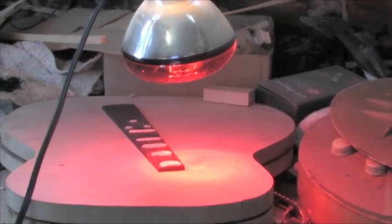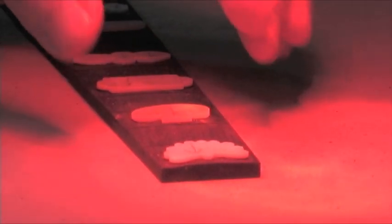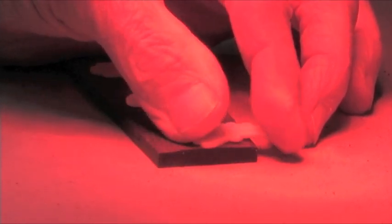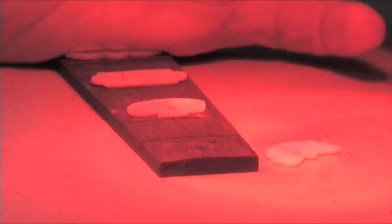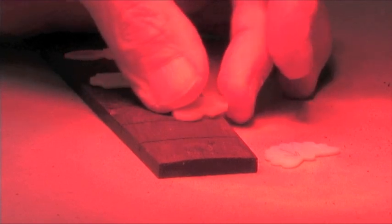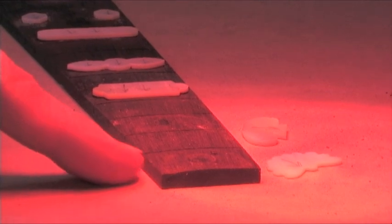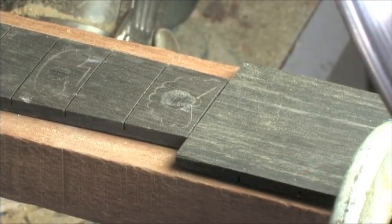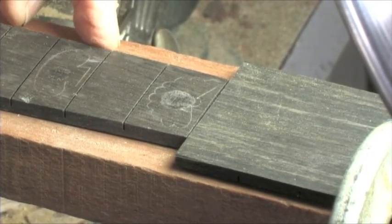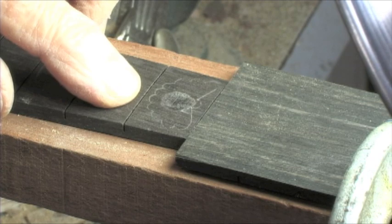Now this has been under the heat lamp for a few minutes and I think it's just about ready to come off, so let's see. I'll just take it with my fingers and give it a little twist. See how easy that is? Now let's see if this one comes off too — yeah, that came off easy. You see my scribe line that's left? That's what we're going to use to route it. I've gotten these inlays completely loose and what I'm left with is a scribe line right there.